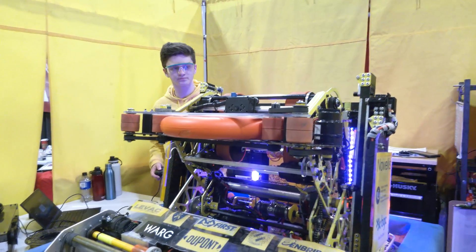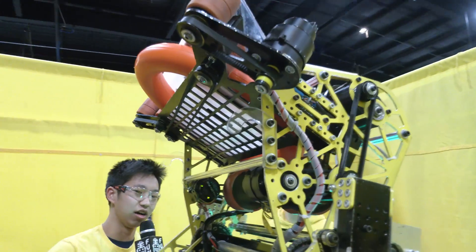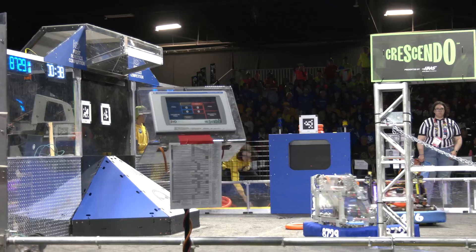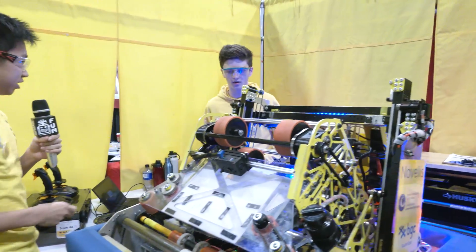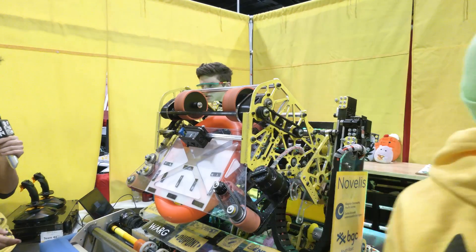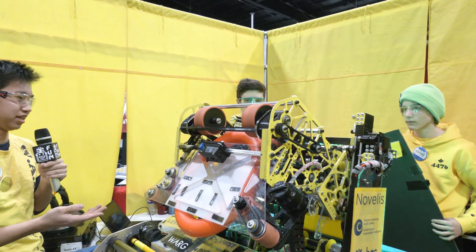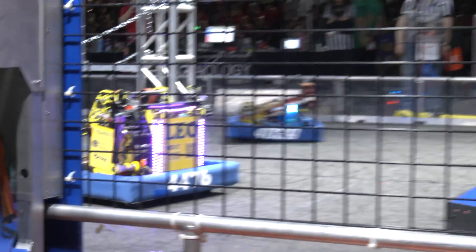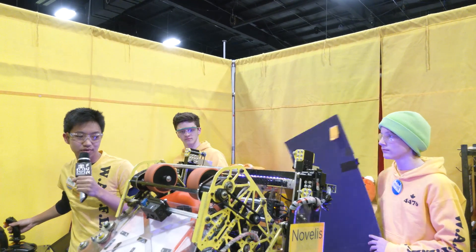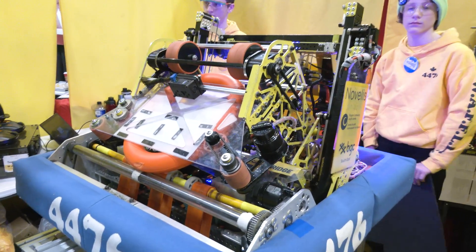Can we see what an amp shot looks like? In amp configuration, you can really see that the pivot helps it out — the shooter bends all the way back to the point where it's actually pointing backwards and downwards, and then we output the note. In regular shot configuration, the first stage hasn't gone up yet — it's just the carriage at the top of its length, and with the shooter pivot we can sink a shot like this. However, if we have defense, something really good about our elevator is that we can just shoot over it. Here's a tall shot — the elevator goes up and that helps us shoot over defense. This is all in the code so it's still able to shoot from the same places, just a different shot configuration.